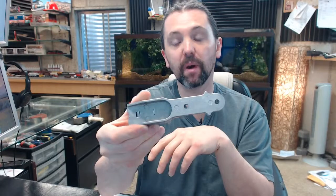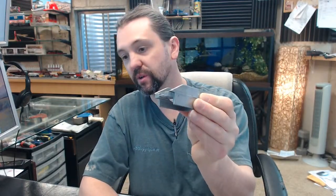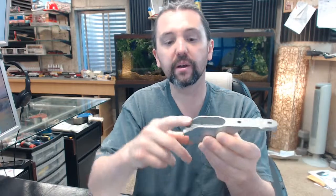So you're going to get the bottom arm that is going to attach to the bottom of your door. This is specifically intended for a 1 9/16 of an inch deep bottom rail, so the inverted channel of the bottom rail, typically of your aluminum doors where I see this, even though it can be used for properly prepped wood doors and steel doors, although those would be unusual, but you could do it. 1 9/16 because of the height of the arm.